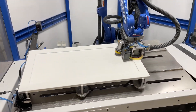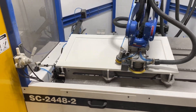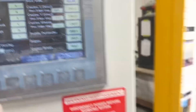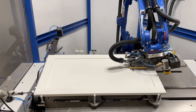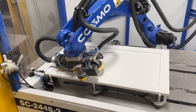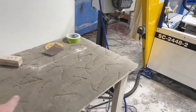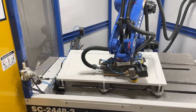It's sanding pretty slow. You can check out our speed right here — she's got it slowed right down. Despite the fact that this one's running really slow, the customer has requested a pretty deep cut on this primer. You still won't see any sand-throughs. It does a fantastic job. One of the benefits is the operator's sanding here while the robot is sanding over there, and that's the magic.